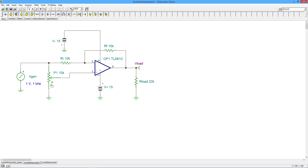When the wiper arm is all the way down, the plus input is basically going to ground. And what you have, really, is just an inverting amplifier with a gain of 1 in this case. Granted, there's another 10K pot out here that's helping to set the input impedance, but as far as the operation of the circuit itself, it's just an inverting amplifier with a gain of 1.